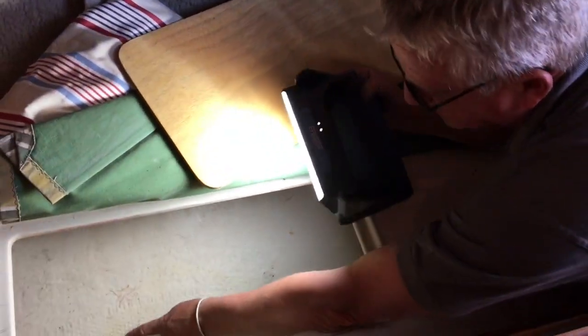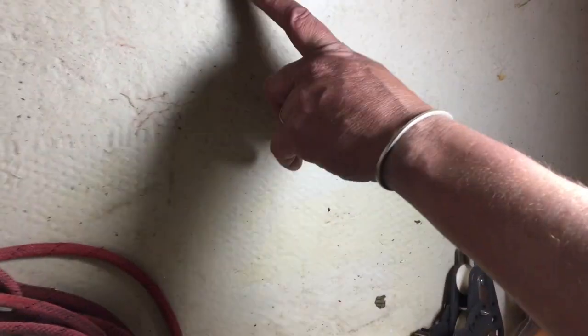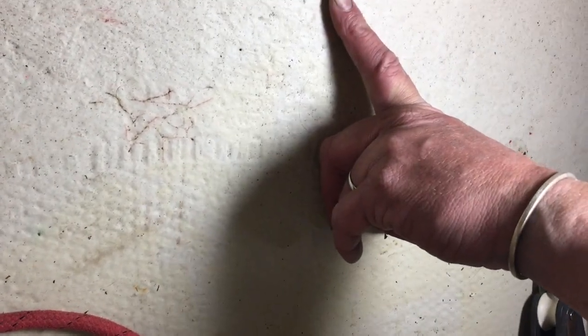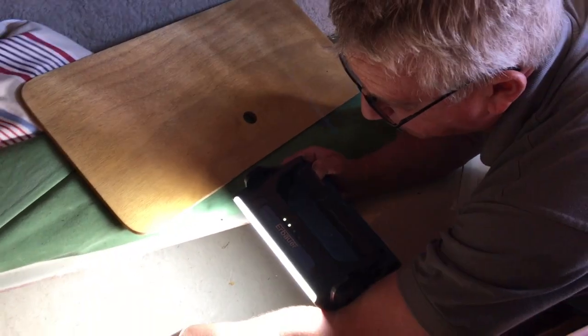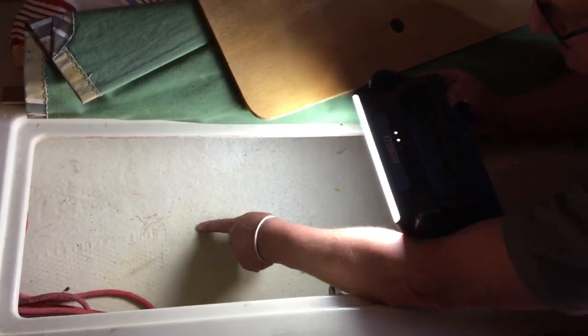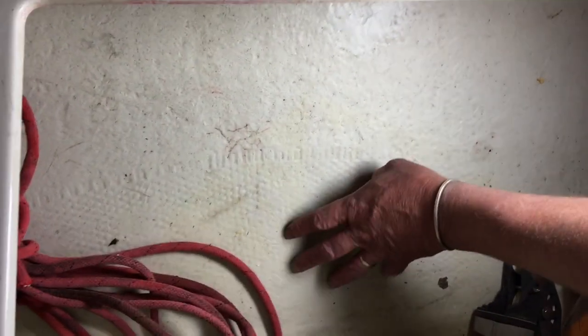You can actually see the woven rovings in the actual build quality of the boat. Most of these yachts from Scandinavian and Finnish areas tend to build with woven rovings more than chop strand, like the Westerlies and the Moodys of this age. It's a more expensive build, but for moisture to get into the end of the filaments it's very limited because the ends of the filaments are like cloth. So water lying in areas like this cannot get into the filaments and start the osmosis reaction in quite the same way.